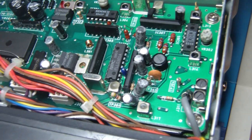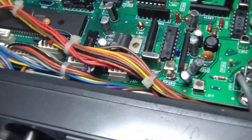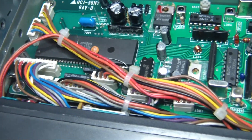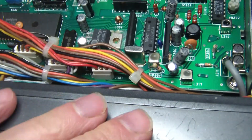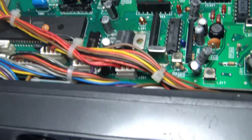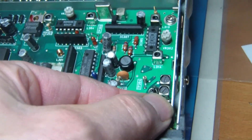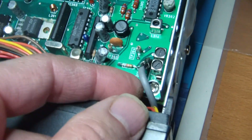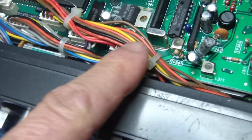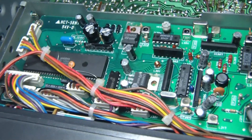Taking the board out is not really that difficult. There are some screws on the side — two on each side — that you have to remove, and then you just pop these connectors off. You don't need to worry much about marking them because all this wire is formed in place and will go back into the same spot. There are also a couple of coax connectors — be careful pulling those out, don't use any tool, just gently pull them.